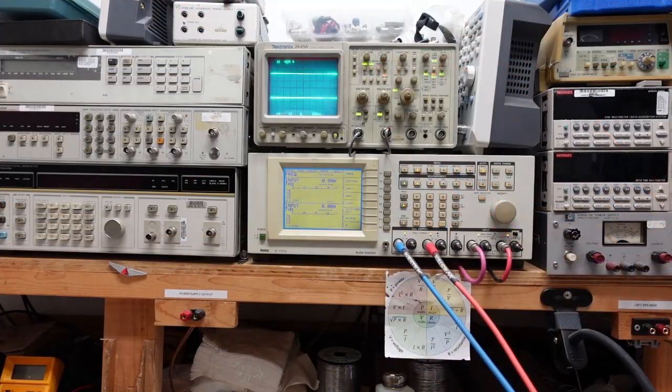Okay, I'm going to turn this back on. Now, we don't hear this click out of protection, and when we're going directly into the main power amp, the controls on the front have no effect, with the exception of course, your speaker selector. So we have nothing coming out of this amplifier.